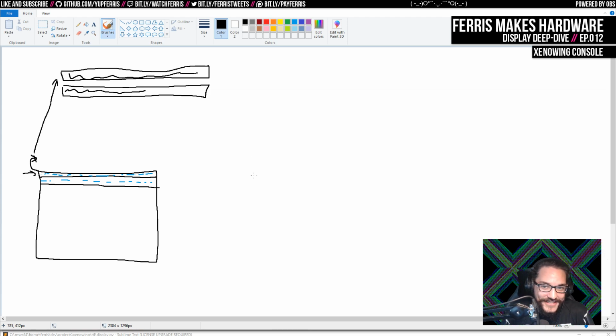But yeah, the caches also help with perf because, again, we do the burst reads. So these actually fill up quite fast. And we'll see that I think I can actually remove one of these buffers. I don't actually think we need to double buffer because it's so fast, but I want to check that out.